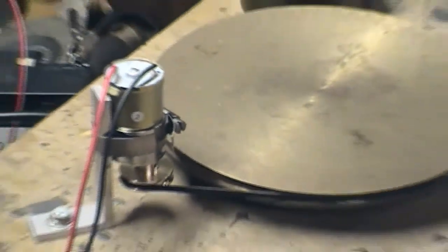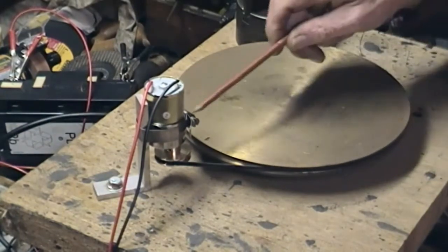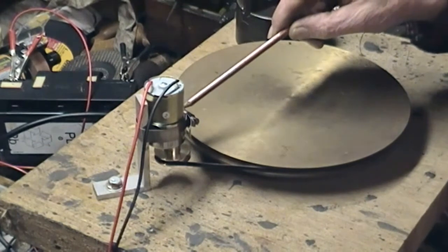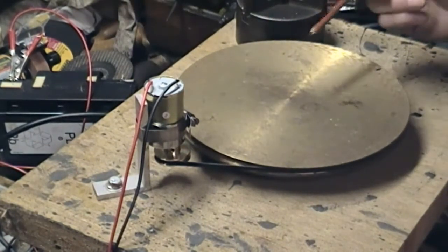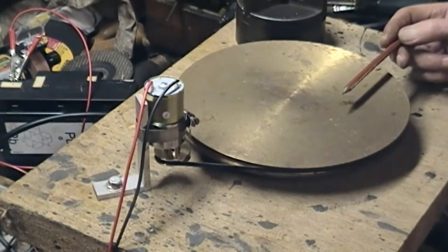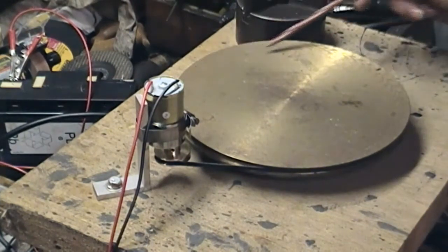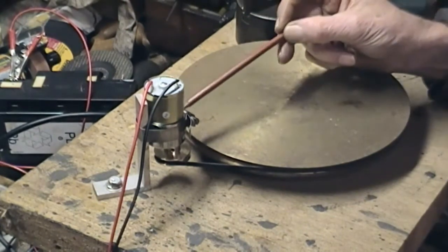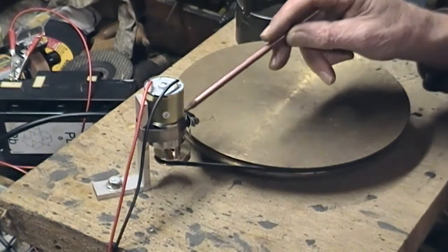The thing I'm probably going to do is get another motor, because these are so inexpensive. I found and ordered one at five RPM. Five RPM translates to one revolution every 96 seconds — so a minute and a half for a full revolution, which sounds pretty good to me. This current one might have been a bit high at 30 RPM, but it was on an auction and I bid and got it, so it was cheaper.